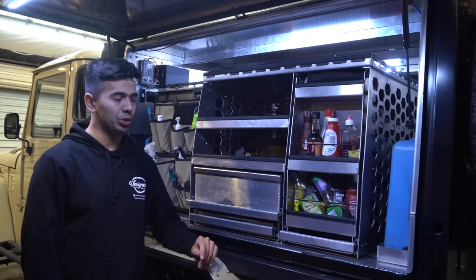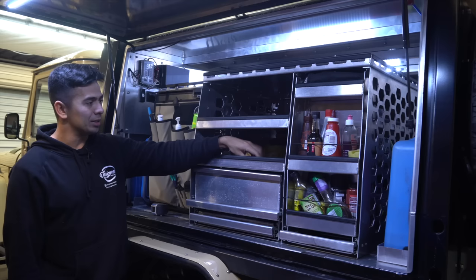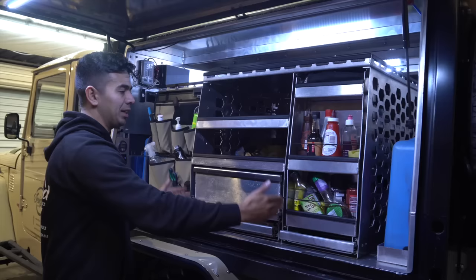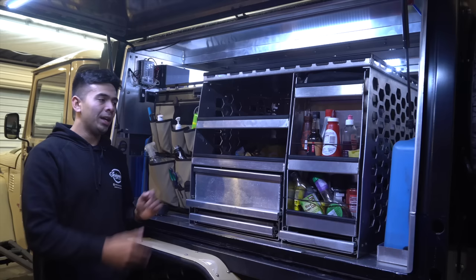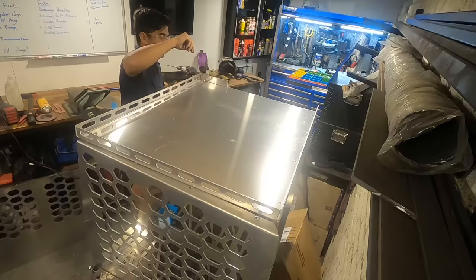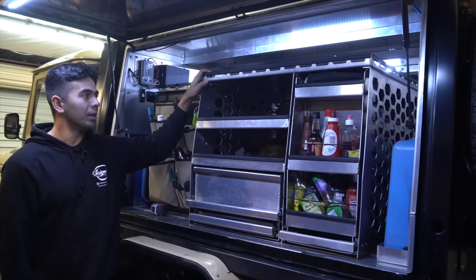Would I have gone 2mm for the carcass? Probably not, because there's so much weight — if you fill this with cans you could almost fit 50 in there. On the bottom I've taken a heap of weight out. The only reason you really need the bottom skin is to space the two ribs so the drawers open and close properly. The top is nutserted on just to minimise welding. I've got adjustable shelves with multiple bolt holes, though I'd probably have to make different shelves because this is on an angle.